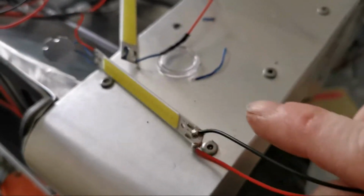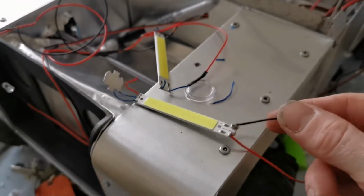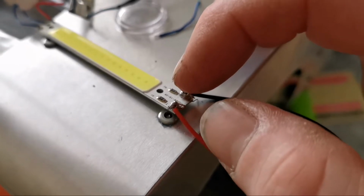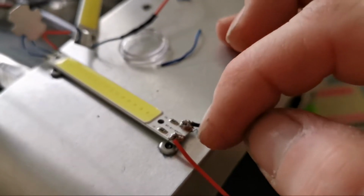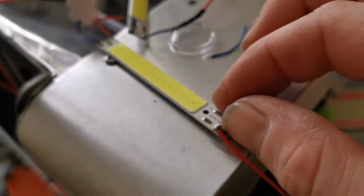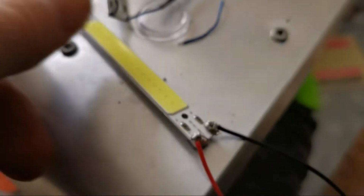Here we're starting to modify the systems by taking out the existing small gauge wire and soldering in thicker, better connections to handle a higher current, because we're going to be running these off various things. We're going around adding thicker gauge wire and building up the solder points on the board like a little stalagmite of solder. We wrap the copper wire around it to create a ball effect, then build up the solder over the top like a cage. So that's modified, nice and sturdy and solid, can handle much more current and be more durable and reliable in use, so you won't need to modify the system later.